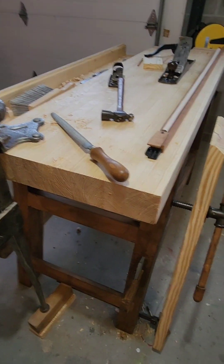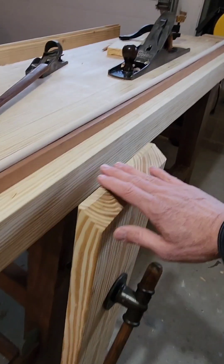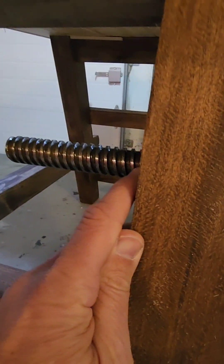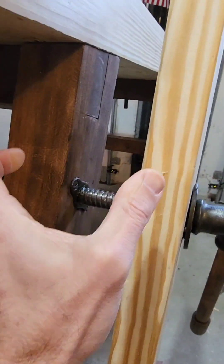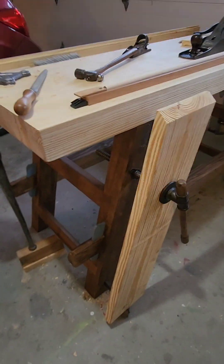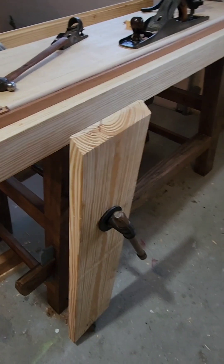That's vice number one, which wasn't typical. This is the typical one here — this is a leg vice, what you would use for woodworking. I have the top even with the top of the workbench. I inset the little nut here, which has a very regular shape. I was thinking of just putting it on the back, but that would have lost three inches of width in my vice. Here's also that rectangular mortise I made to hold this leg vice bar, which prevents the leg vice from swinging back and forth and helps provide more pressure when clamping a piece of wood.